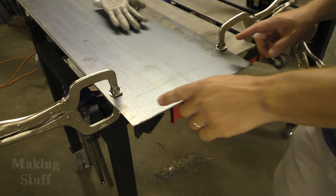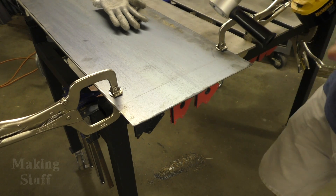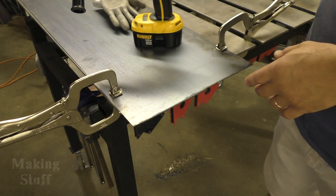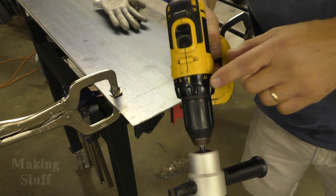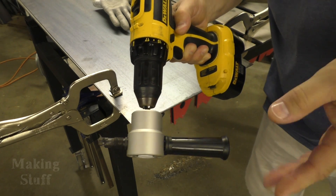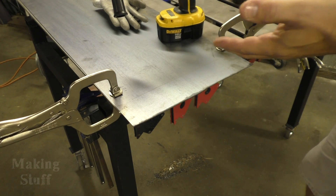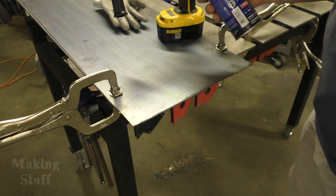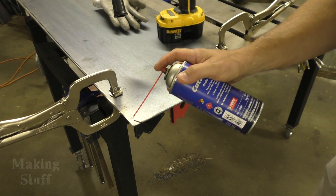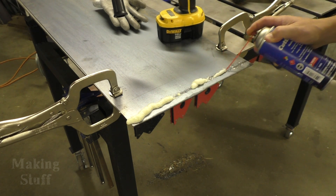I made that first cut and then I tried some larger pieces of sheet metal for the CNC machine and had some problems, but it turned out to be operator error. I switched over to an impact and it started making really good cuts again. I realized on my drill the clutch wasn't set to drill mode — it was slipping on the larger cuts. I also noticed it was getting pretty hot, and the packaging says to use cutting oil. So I'm going to try this long cut again with cutting oil and the drill set correctly.